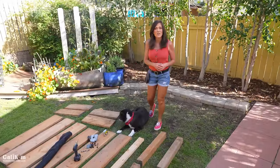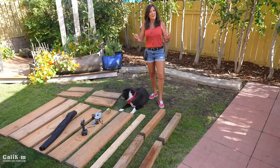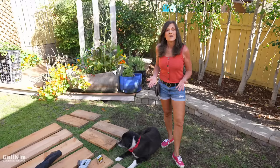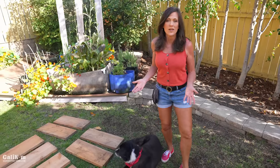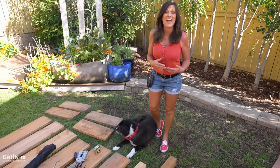Now let's talk for a minute about the type of wood we're using. We're actually using Douglas fir. There are so many options — cedar and redwood are naturally rot resistant and pest resistant, however they cost a little bit more. Douglas fir and pine are not rot resistant or naturally pest resistant; they don't last quite as long, but they're less expensive. There's always the debate of treated versus untreated wood. Treated wood has chemicals to help with rot and pest resistance, and the treated wood these days is a lot safer than it used to be. But if that's a concern, you might want to use untreated wood — just keep in mind it will rot a little bit quicker in a humid or wet climate. Basically, just choose the wood that fits your situation and your budget.